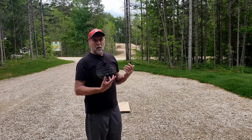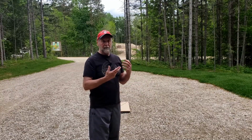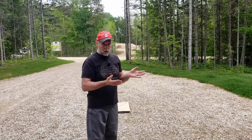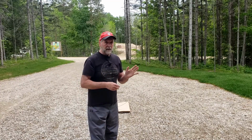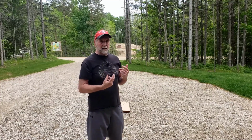We're going to restart the drone, restart the controller. We know we've just calibrated correctly, even though it's not what the book tells you to do, but we have a successful calibration. I've recalibrated the gimbal, the auto calibration. Remember last time on version 1005C and 6C, I had to manually adjust. In 5C, I had to go to -1 on the R-axis, and on 1006E, which they addressed the issue a little bit, I only had to go to -0.6. Okay, so not quite as much.